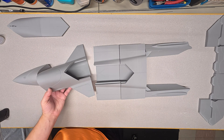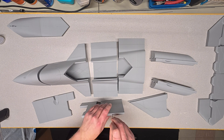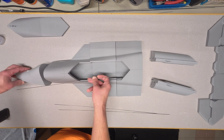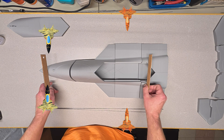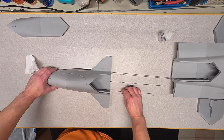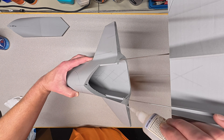Let's start by making sure we have no clogs in any of the holes where the steel wire or carbon fiber will be inserted. Do this for all the fuselage and wing parts. The use of steel wire or carbon fiber is completely optional, but it does help to align the parts, limit the amount of PLA used, and help hold the model together after much battle damage. These first 3 wires are meant to strengthen the battery compartment and help keep the nose from breaking off. Insert 3 yard flags into fuse 1 and guide the other end into fuse 2. Apply glue to the front of fuse 2 and slide them together. Keep the steel wires forward as much as possible. Now would be a great time to cut these wires to length. Apply glue and slide fuse 3 into place, keeping the wires forward as much as possible.